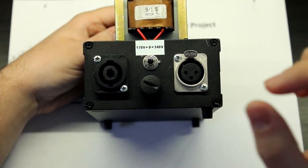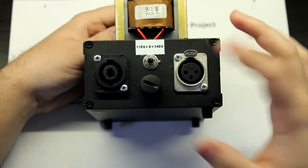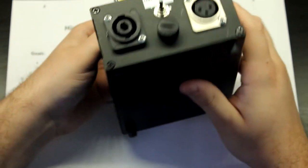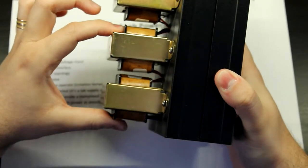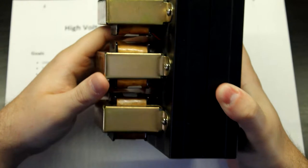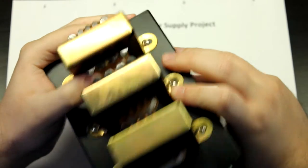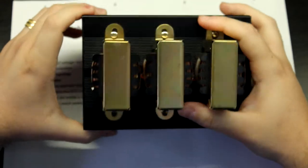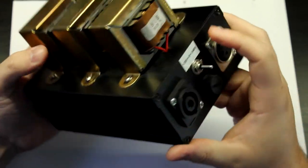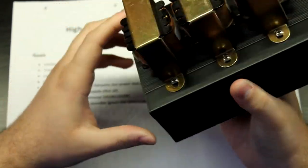So I just had an XLR cable that came in here and had separate cables so that I could power my prototypes. So yeah, again, same thing as before, the two back-to-back transformers, and this is just an auxiliary transformer. In this case, I've used, let me just see here, 12 volts at 1 amp transformers, okay? These are from Brazil, so we don't have VA ratings there, apparently. They're all rated like this. But yeah, let me open this one up, and let's see what it did inside.